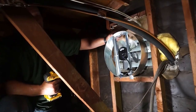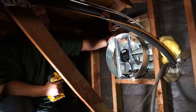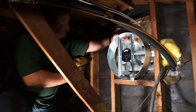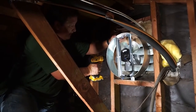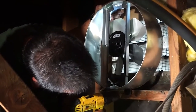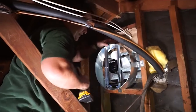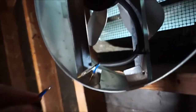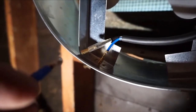We're ready to install the fan. It's a natural fit between most dimensions for the attic vent, so you're just going to take up the space in that gap with some simple cardboard, push it up, fit it into the gap, and plug it up. Nice and solid. Now we're going to go ahead and wire this up and get the wire through the roof to connect to the solar panel.